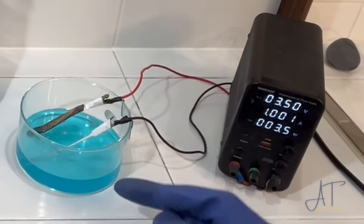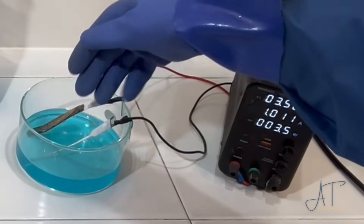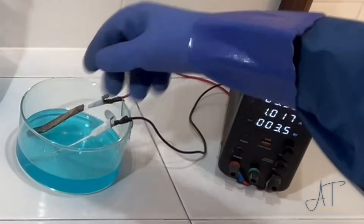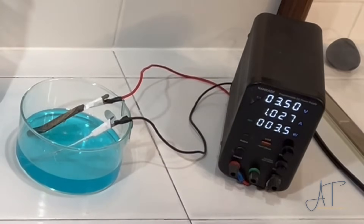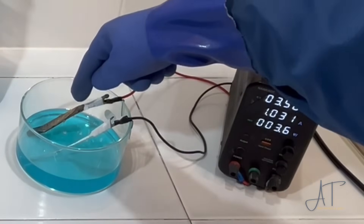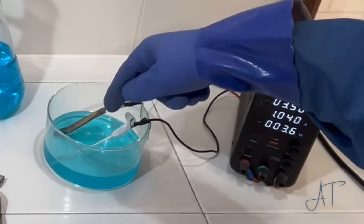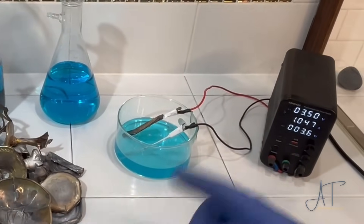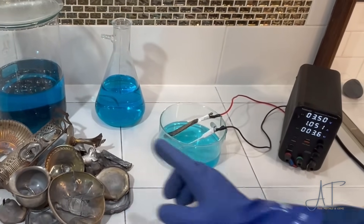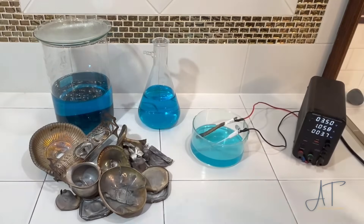The reaction taking place here is the sterling anode is dissolving into solution. At the cathode, pure silver is going to plate out — this piece should just get thicker, full of pure silver. The anode will dissolve into solution with the copper staying in solution and only the pure silver plating out on the cathode. If this test is successful we'll run a larger experiment right in this main beaker. I'll let this run for a little while and then we'll come back.